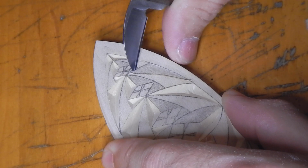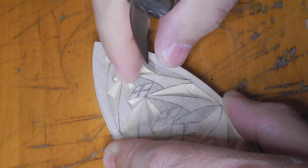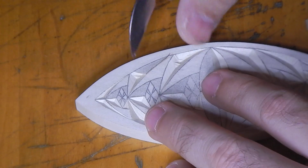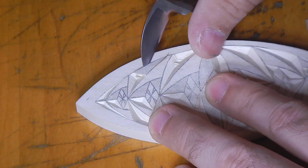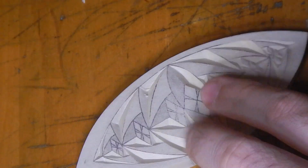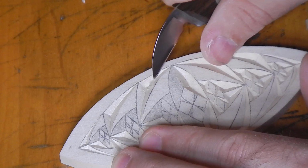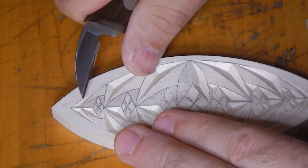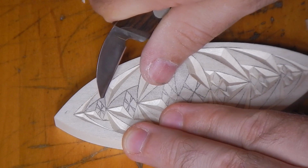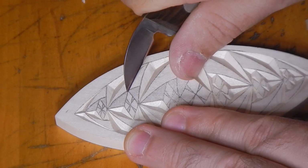These chips are a little bit, I find anyway, more challenging to get it to connect up here on this kind of obtuse angle in the middle to get the tip of the knife down in there. So once I come here, kind of push the tip of the knife in, get that to finish the cut. So again, doing these two cuts together as one motion.